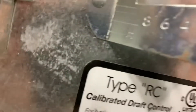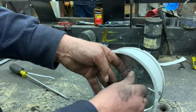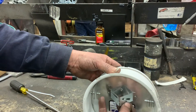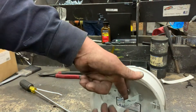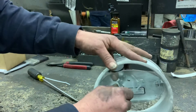Now, if the flue pipe's going vertically, you have the weight on the right side. If you're going to put the barometric damper right on the end of the furnace where it comes out horizontal, then you got to change the weight from the right side over to the left side, because the left side's for horizontal mount and the right side's for vertical mount.